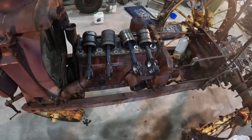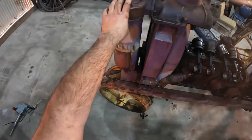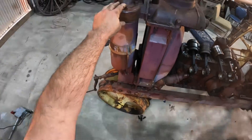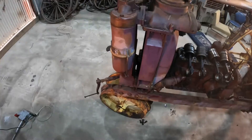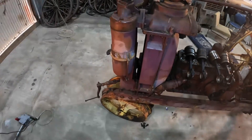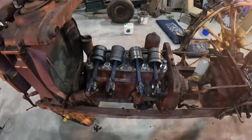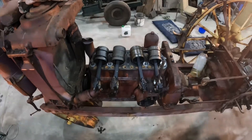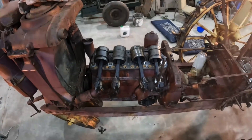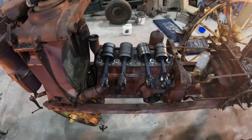I think most of its other work was probably chasing and rounding up cows, so it may not have done a lot of hard work. These tractors also originally had notoriously bad air cleaners — this is the air cleaner up front — and when new they didn't have much of an air cleaner at all. A lot of them started burning oil very badly in the first 18 months, so they came up with an upgraded air cleaner, and many needed a partial engine rebuild at that point. This one may have had a partial rebuild in the first five years of its life. Anyway, I hope you've enjoyed this video and learned a bit — hope to see you next time. Thanks, bye.